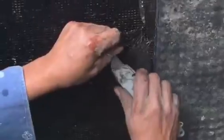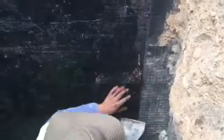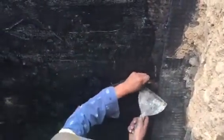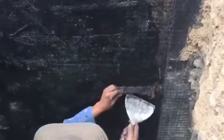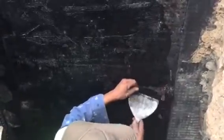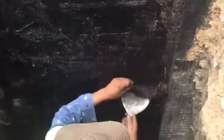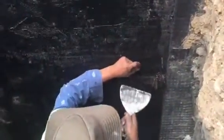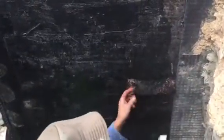The reason for that fabric is to reinforce the waterproofing — isn't it, Keith? Yeah, it's a reinforcement. If there are any cracks that come into the slab, it helps reinforce it. You usually use a fabric like that when you're going thicker mils, like maybe 90 or 120 mils, to help the material bond together. Most systems aren't normal to do 120 mils without some kind of fabric.